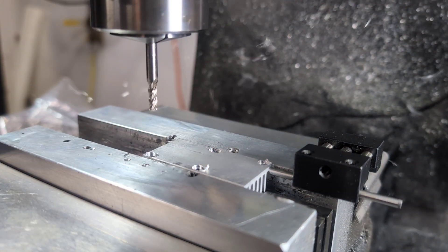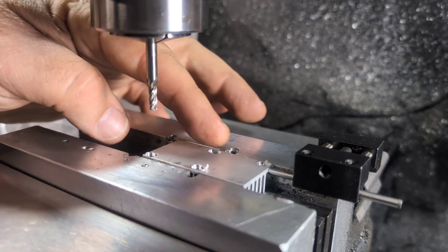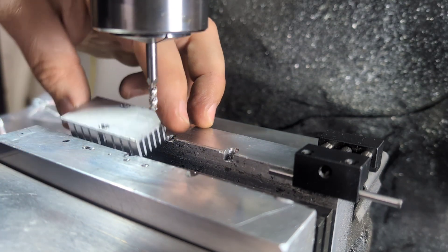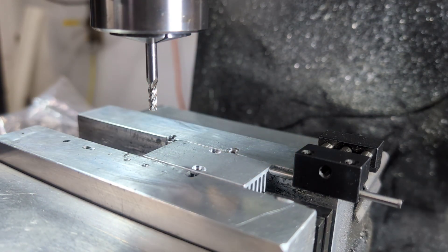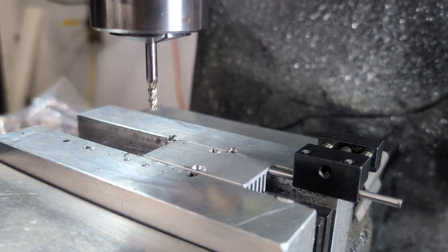This could probably easily be done on a CNC machine, but this is a quick and easy setup. I'll probably get this done quicker this way than if I'd made a program and run it that way — unless I'm running 150 of these, which I'm not, I'm only running four. You only get the economy of scale with CNC when you scale up in parts.